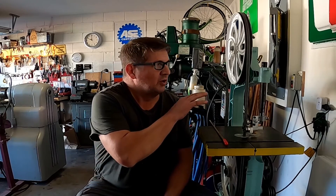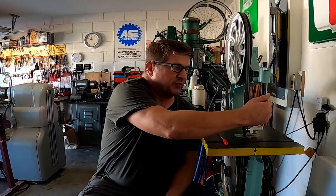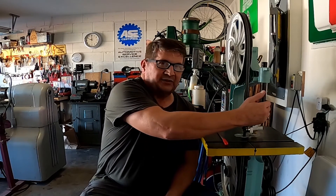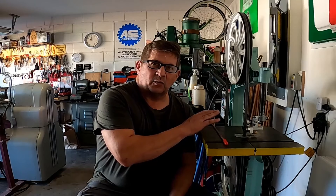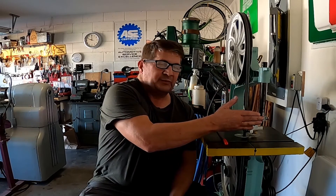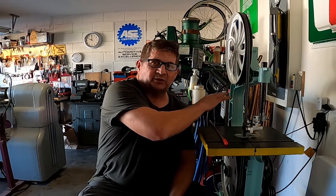In this case, we want to find out where this arm is flexing the most. We know it's moving off about five thousandths down here, but this is obviously amplified from some type of twisting motion up in here. We want to find out where it's really twisting - because the amplification isn't the problem, it's the twist. So before we start beefing that up, let's do that.